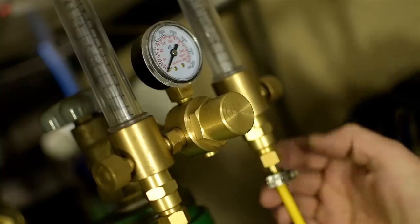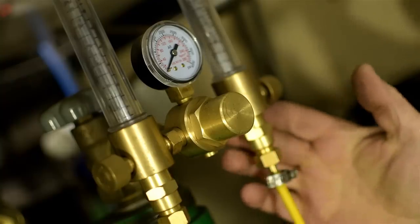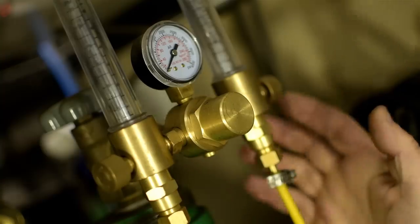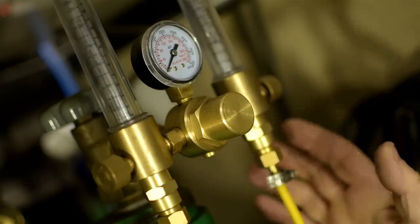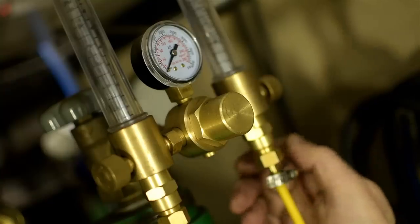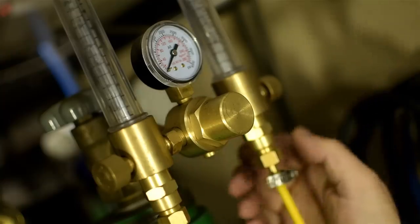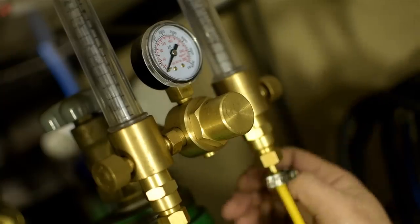I've temporarily plumbed the oven to the second tap on the argon for the TIG welder. Long term, I plan to run the oven on nitrogen. For reasons that remain a mystery, I have quite a few bottles around that are more than half full that I can't use anymore. But I have no way to regulate their pressure, so for today, argon it is.